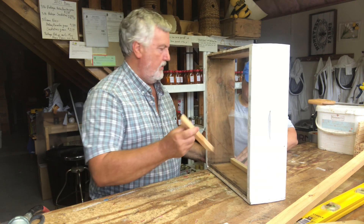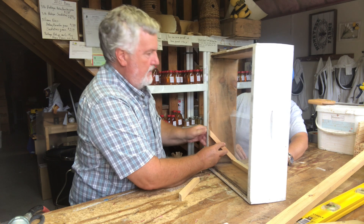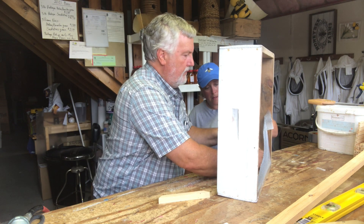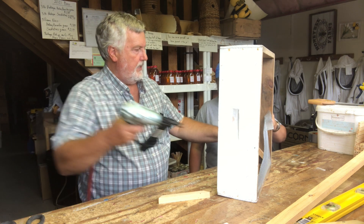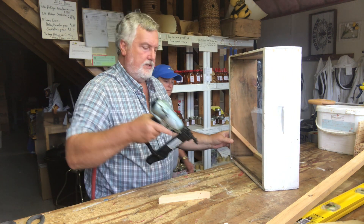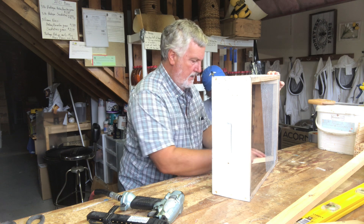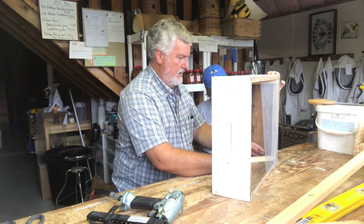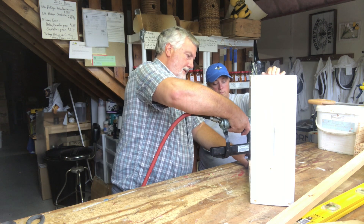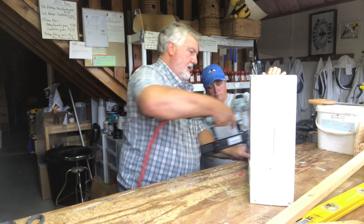What we're going to do is put in a couple of pieces with 45-degree angles cut into them and they're going to go in here. You can see what I've got — we're going to go 45 degrees and this is long enough to go in here. We'll just tack it into position there. We're going to also tack it into position here and we're not going to do anything else besides that.